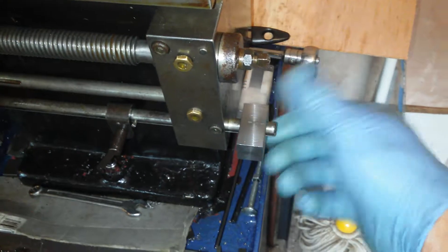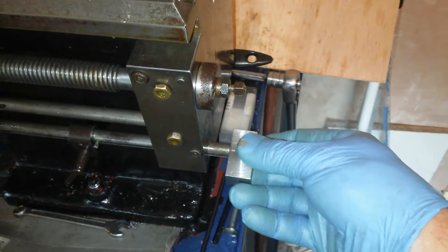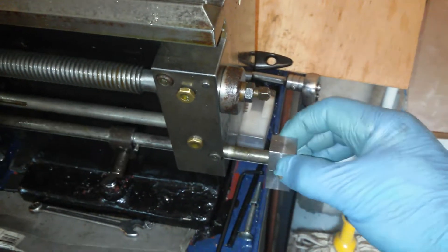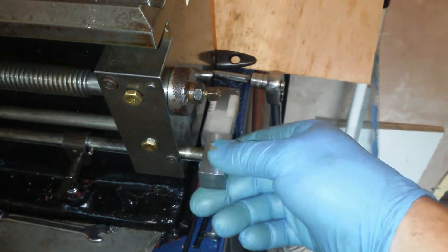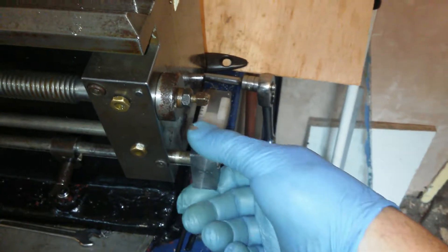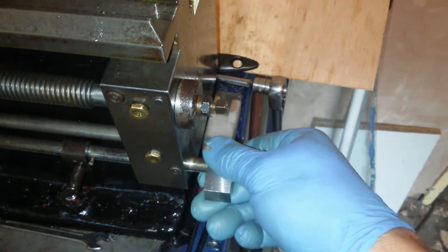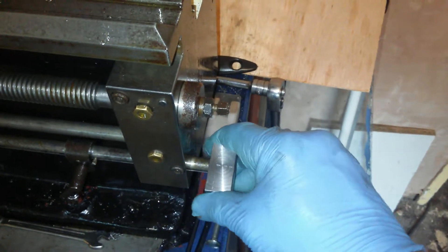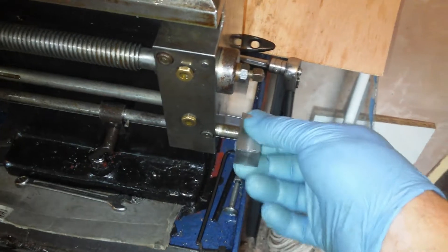It's on and it brings the old shaft with it. You can get it off - it must have a slight taper when it gets a bit harder to put on that way. There might be a burr in there. And that is good - so now I just have to drill the hole through that side for the pinch bolt and then slit it.